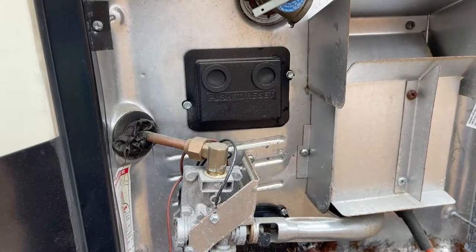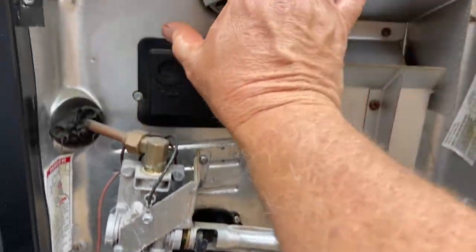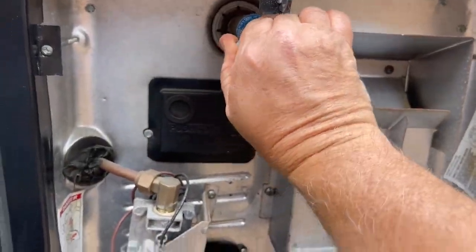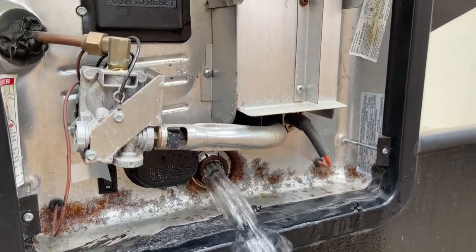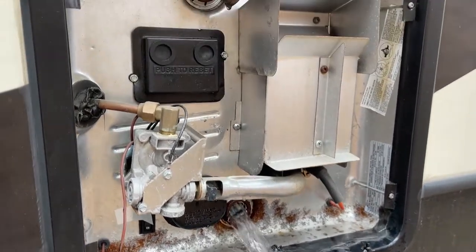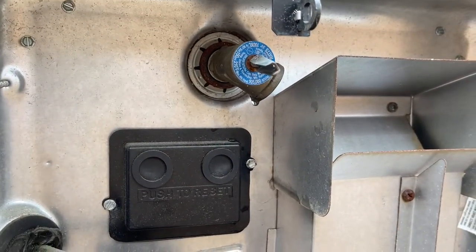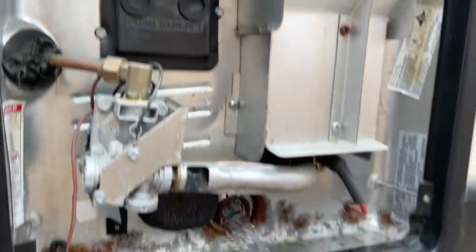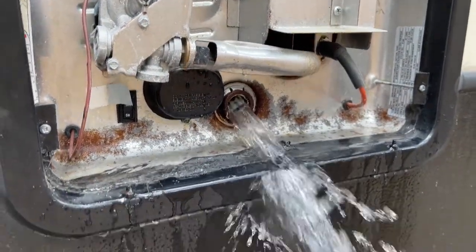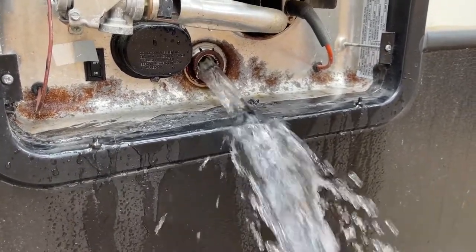Here's a pro tip: see how it's chugging — chug, chug, chug. If you open the relief valve at the top, it vents the top of the tank and now you get the water really coming out. It's actually a good thing for three reasons: one, it's good to exercise that valve since it's often a source of drips when it's just been sitting; and also, because the water is coming out more forcefully, it will carry the sediment out better.